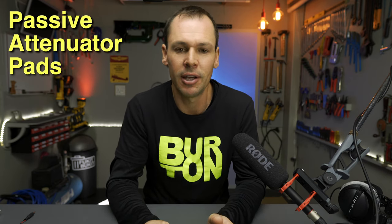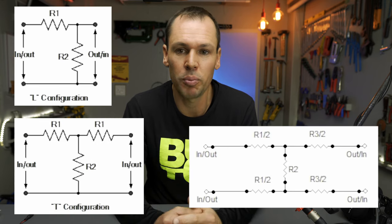As we can hear, it is definitely a configuration problem — we shouldn't be sending line out signals into a microphone input. So if you don't want to buy one or you're keen on DIYing, you can make one yourself. If you search online, I spent hours researching how to make passive attenuators — they're basically called passive attenuator pads. It's just a resistor pad, a voltage divider, and you get a couple of different schematic designs. They mostly use three, four, or five resistors and they're called L-pads, T-pads, H-pads, or a pi-pad.